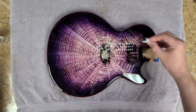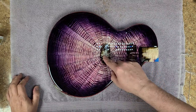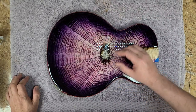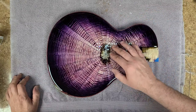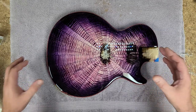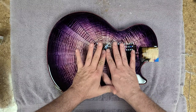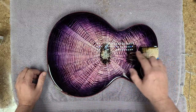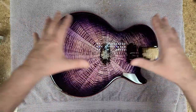There you go. Now there shouldn't be any epoxy resin inside of here, but there is a foam pad inside of here. And what that foam pad is doing is, when I put the veneer on the first time, the suction from the vacuum bag that I put this in kind of pulled in a lot of these areas here, pulling the veneer into it.